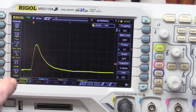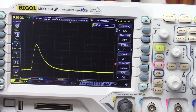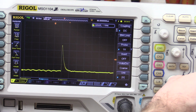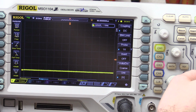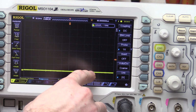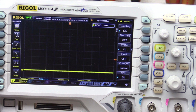So I'm curious to see what happens if we connect, say, a 1 mega ohm load. Right now the only load that's on there is the microcurrent. So let's connect up the 1 mega ohm load. And it does seem to me that the scope updates a little bit faster now. So we might have a more frequent pulse. And yes, we're down to 150 milliseconds between the pulses.